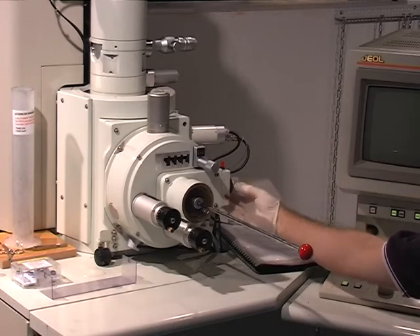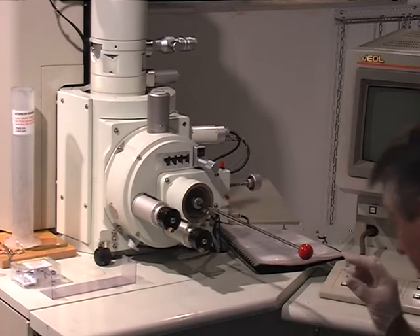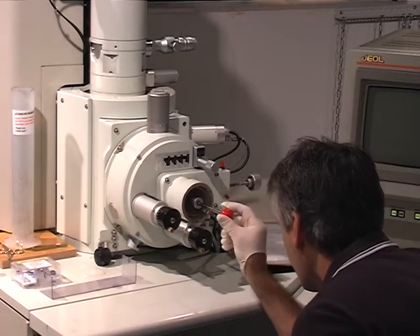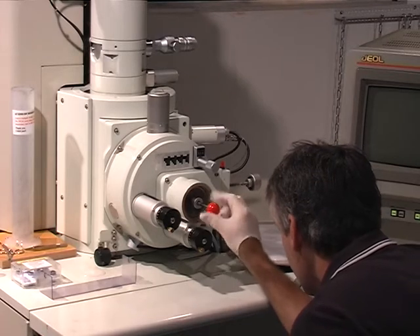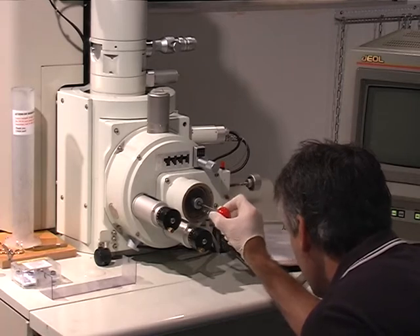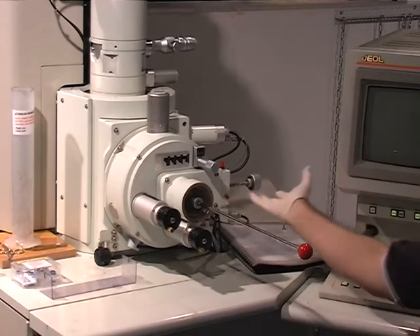Open the Manual Chamber Door. Gently turn the knob towards you one quarter turn. Pull the knob out. Push the Sample Rod in to collect the Sample Stage. Look at eye level to ensure the threaded end engages with the Sample Holder thread. Turn the knob gently clockwise until it stops. Pull out the Rod with attached Specimen Stage until it clips into the fully out position.